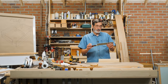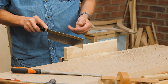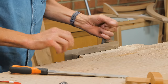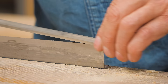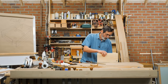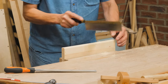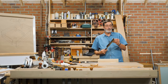When you've just bought a new dovetail saw, tenon saw, or anything like that, and you start sawing, it starts biting on the wood as soon as you offer it — it's not doing what you want. Take my tip: take a smooth flat file and on the first tooth take a pass, then hit three, four, or five more teeth and take those down. When you start the saw in the wood those first teeth barely cut at all — but watch — it just glides into the wood every time, there's no stumbling at the start. You'll love that little tip — just the first half dozen teeth.